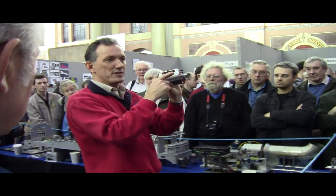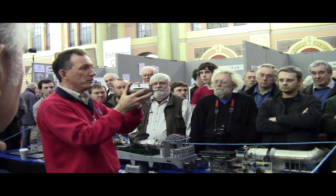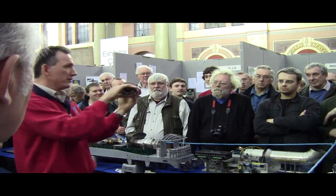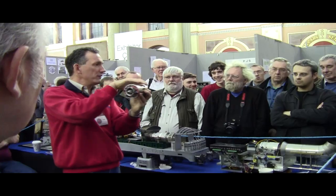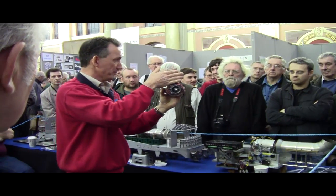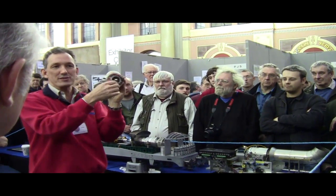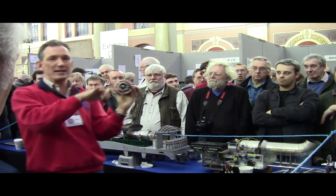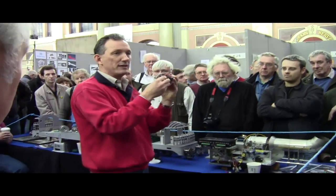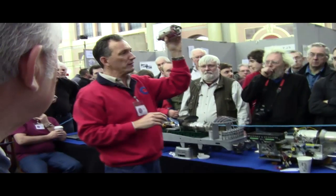The fuel pump starts to slowly introduce kerosene. You'll then hear the note of the exhaust suddenly start to rise in pitch — you can hear the energy coming through the exhaust. The electric motor continues to accelerate the rotor up to what is called the self-sustained speed: basically the point at which the gas velocity out the back end is sufficient for the turbine to take energy from that gas flow to drive the compressor. That happens on this engine at about 26,000 RPM. For safety, the electric motor continues to drive the rotor up to 30,000 RPM before it disengages, giving a nice safety margin. The turbine then drives the compressor by itself, taking itself up to its idle speed of 45,000 RPM.